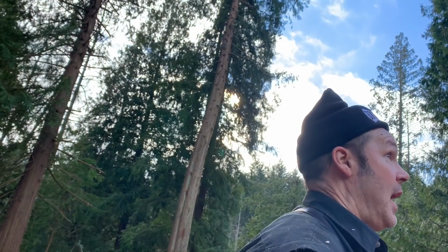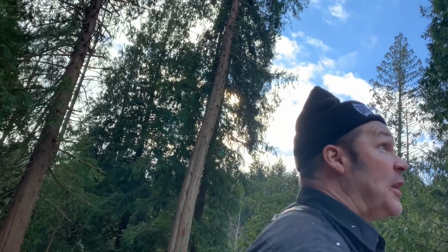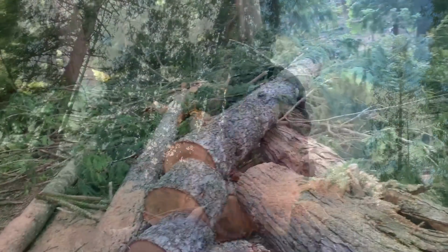Ganges is grabbing his raker gauge here now. We'll get his saw cutting a little better. It's not cutting that great, to be honest with you. I think he needs to hit the rakers, so he'll just do that now. That's it. I'm hitting the rakers. Oh yeah, but son, you got to remember, that's cutting freakishly good. So friends,